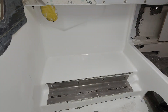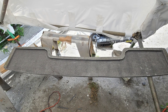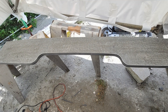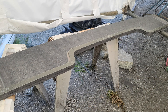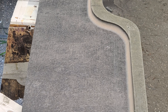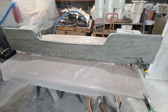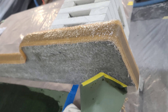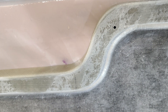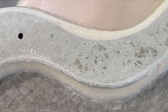Here's another coat of gel coat in the engine compartment across the rear bulkhead, up the sides, up underneath the gunnels. Now the rudder shelf is getting the thickened edge — it's actually the cutoff from when I cut the shape; I reused it. Sometimes you get lucky. There's a pillow block set in place. I've got that rudder shelf clamped with the face pointed up and I'm wrapping it with some 1708 and chop strand mat to build up that edge. You can see it's very well built up. The fiberglass layup top and bottom will both overlap, but I really wanted a nice thick edge.